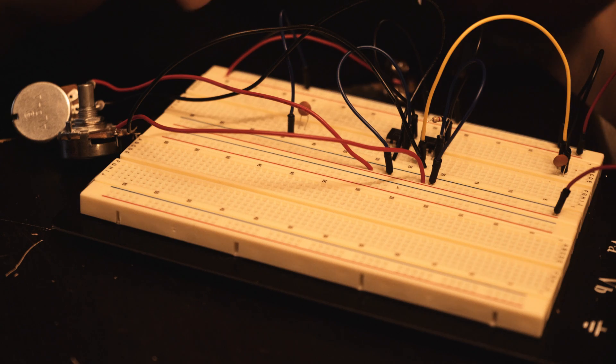Now we need to connect pin 4 to the power. This is where we start connecting the two 555 chips — basically you're connecting the output on the first chip to the trigger on the second chip. Since we're talking about it being astable, that's going to be a constant square wave going directly into the second chip. On the second chip we're removing the resistor and just putting a straight wire, connecting the discharge and the threshold to each other with no resistance — just a straight wire.